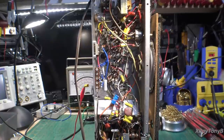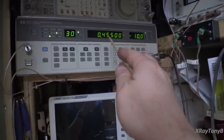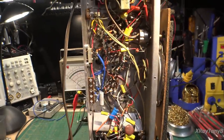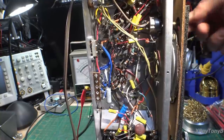It looks much better now — we got all of those bumblebee capacitors removed, and pretty much all of them were reading high. I've taken the signal generator and connected it to the antenna input. The signal generator is set at 455 kilohertz, negative 10 dBm — which is a really hot signal — and I'm using only 30% modulation. Turning this up, we have got 455 kilohertz.